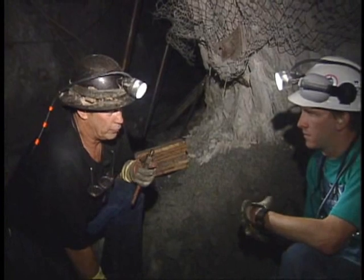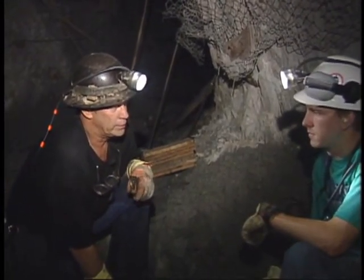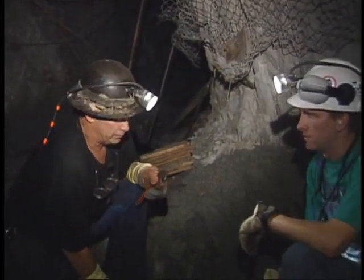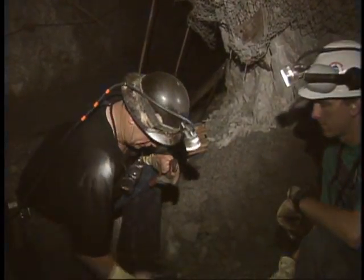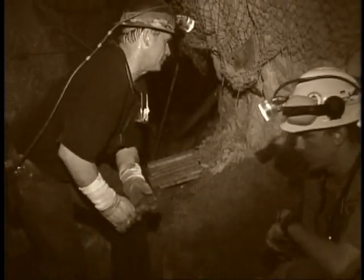But if you're in a bean hole or on a climber or any raise that you're running, it really gets difficult to drill up. When you're drilling the walls, it's fine. But sometimes they're a hazard if you're trying to mine up. So over the years, most of us have learned to duck.